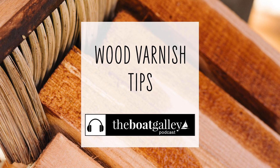Tip number two: foam brushes. I'm not a professional nor a perfectionist, but foam brushes are absolutely 100% our favorite way to apply varnish. You don't have to worry about brush marks. You don't have to worry about cleaning up brushes with toxic chemicals or wearing a respirator. They're cheap enough to throw away, they do a great job not showing brush marks, and we particularly like how they work with varnish.